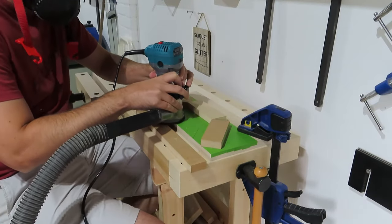So let's look at each one individually. This was the smoked eucalyptus, cherry and walnut with the cutter going with the grain — really like this, came out sharp. Simple, quick, looks clean — pretty happy with this one. This one did not work for me — pretty dodge, plunging the cutter straight into the hardwood. Also a lot of burn marks from the router and the edges were starting to give way, so not a good one. As before, the straight cut worked really well here, even with the edge banding, and I was quite surprised that even going across the grain you can get a nice clean finish.